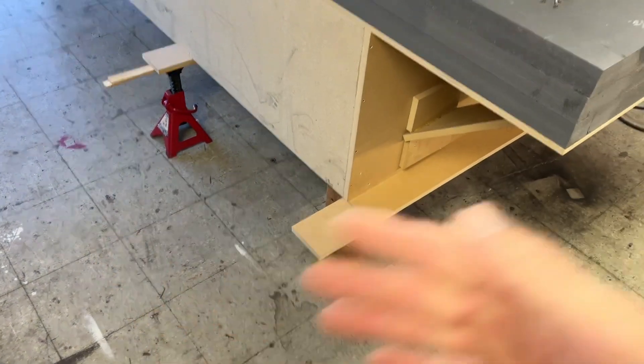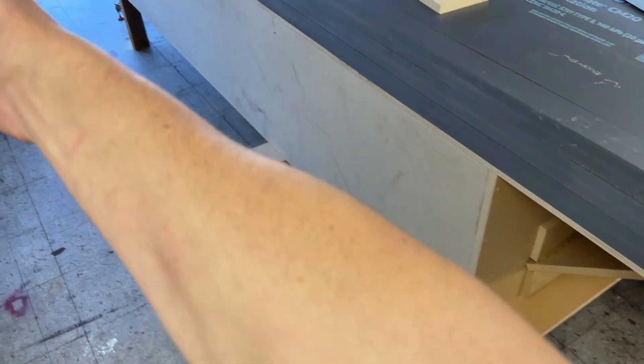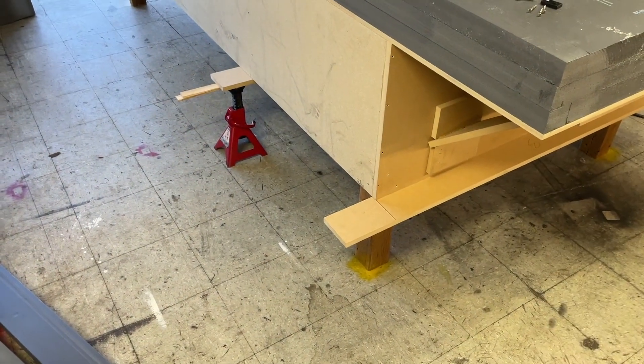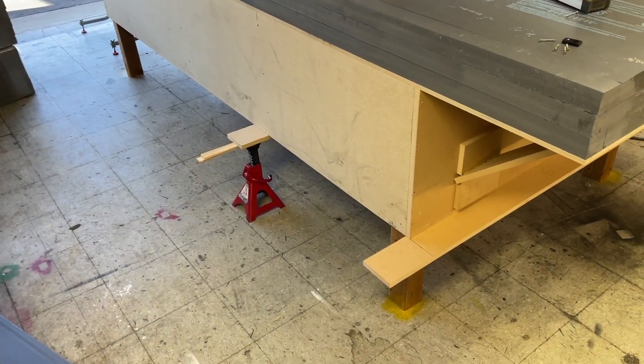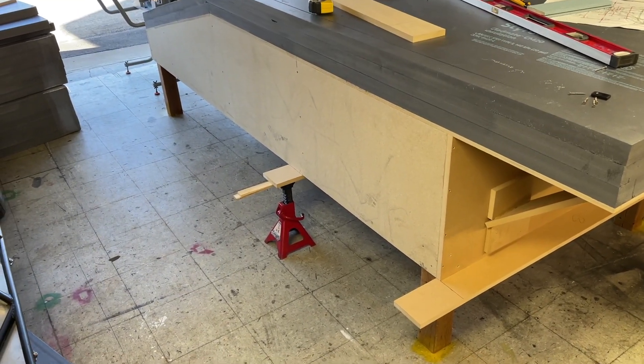So I don't have to just layer the whole thing up with four or five layers on each side and then carve this shape to it. I can build it up generally to that shape, and it's just less to carve. It'll keep things a lot more symmetrical as I go left to right if I don't have to plow through that many more layers.